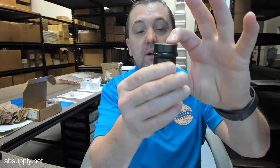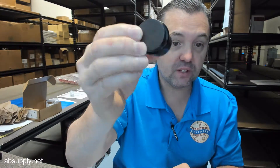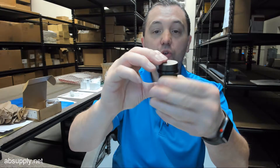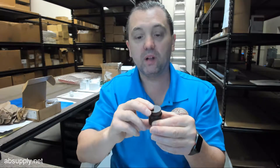It's a modern-style doorstop that has the following specific dimensional properties: an inch and a quarter height and a base diameter of inch and a quarter. This is made of solid brass, and the finish shown here is what is called US-10BE or 613E. That is an oil-rubbed bronze equivalent, meaning it is a powder-coated type finish that is going to remain stable versus the oil-rubbed bronze, which is considered a living finish that will change in color with time — not so much with a doorstop because it doesn't come in contact with people pulling on it like a door pull handle would be.